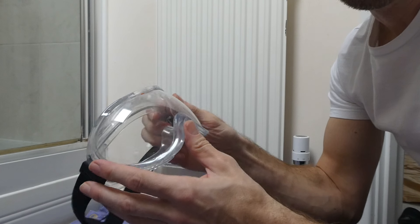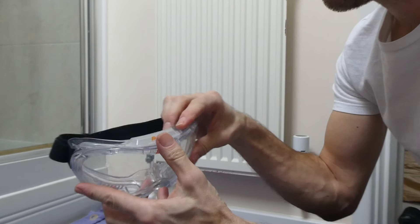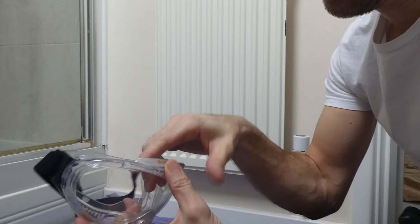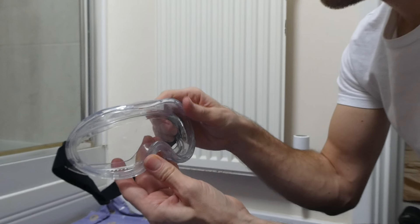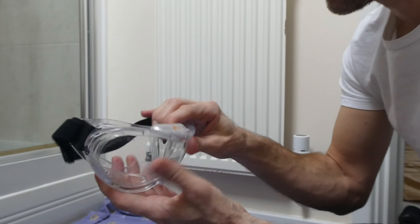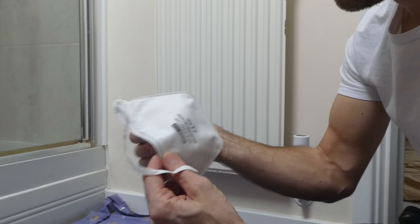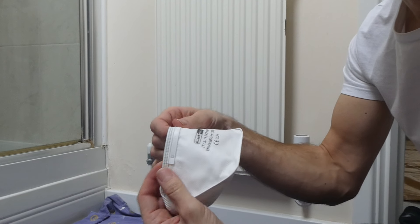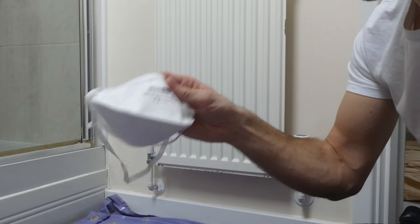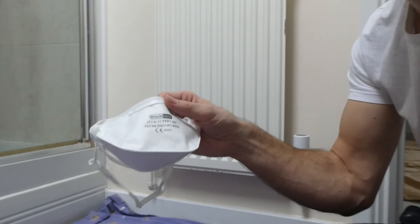Now if you're doing a job like this, make sure you've got yourself some decent PPE. First I'd recommend a pair of goggles — just like this pair that seal around the majority of your eyes. It's going to be a lot better than just a standard pair that look like glasses. You really don't want that black mold getting around your eyes, and then the other thing is a face mask. It was one I had hanging around in the van, but we're going to use it because we don't want to be breathing in any of that dust, particularly once we start scraping from the ceiling.